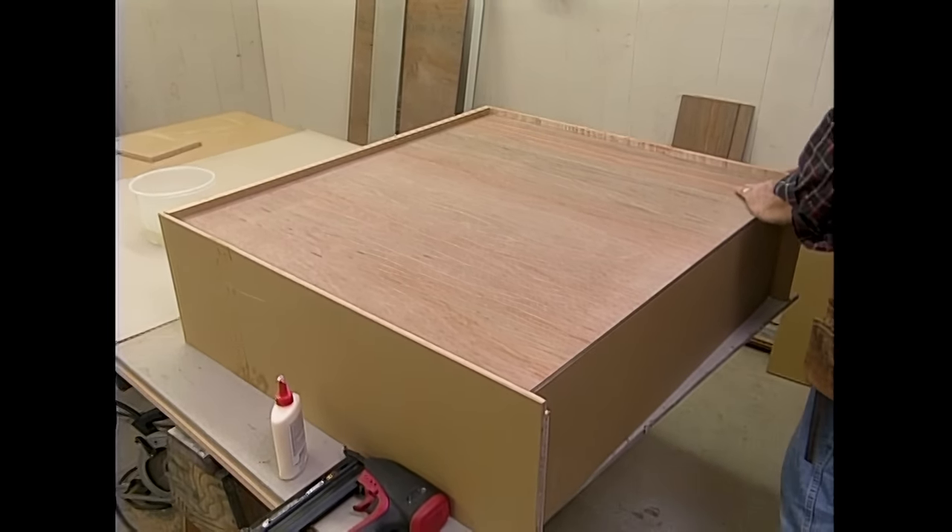With a little bit of glue in the groove, I'm going to set the bottom in place and attach it with some brads. At the top back of the cabinet, I'm applying some glue for this six-inch cleat which I'll use to attach it to the wall. This is the front cleat to tie the carcass together — a little bit of glue and some screws through those pre-drilled holes. With glue at all the joints, I'll attach the other side using the same methods. This strip of plywood goes at the back of the carcass, underneath the bottom shelf, to provide some additional support — just some brads to hold it in place.